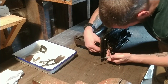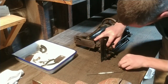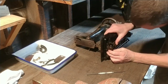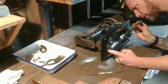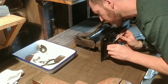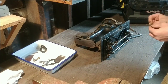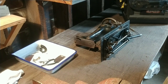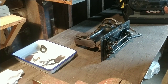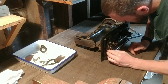I was happy with the shuttle mechanism — it actually appeared to be timed correctly. If you go back and look at that clip, there's a little bit of slop on the needle bar and I wonder if a bushing isn't worn or something. When I pull that assembly out I'll have to look very carefully at all of that. The needle bar goes up, then bobs back down for a split second, and then goes up again. Hopefully this shouldn't affect it — as soon as it starts coming up, the loop is formed and the point of the shuttle is right there, so it really should work based on what I'm seeing.